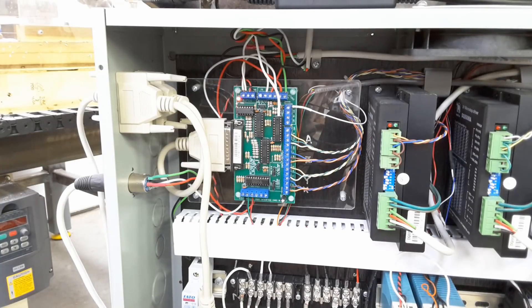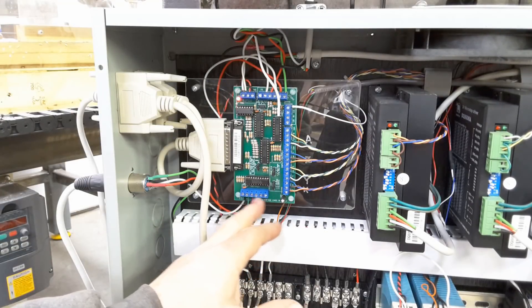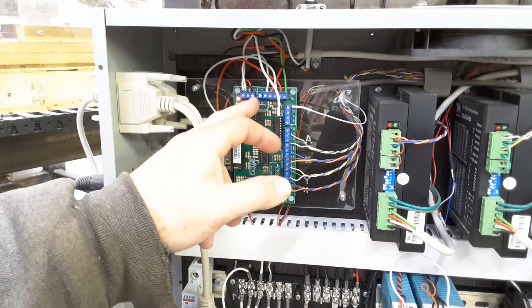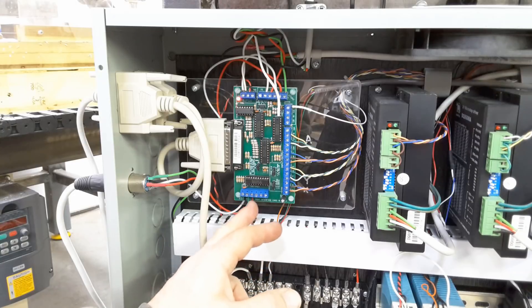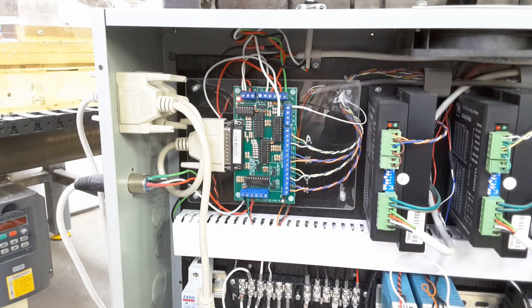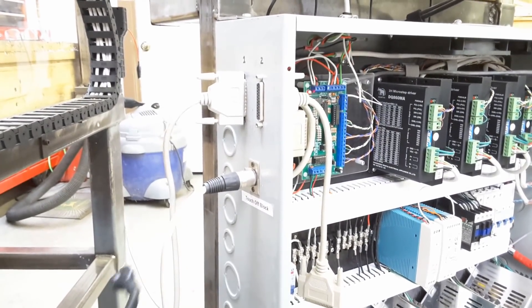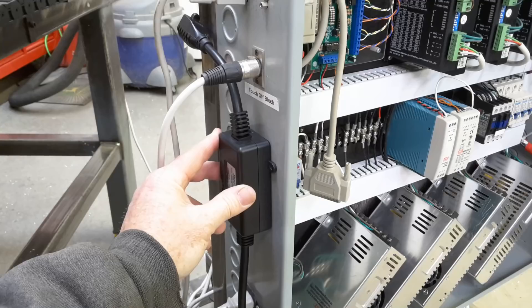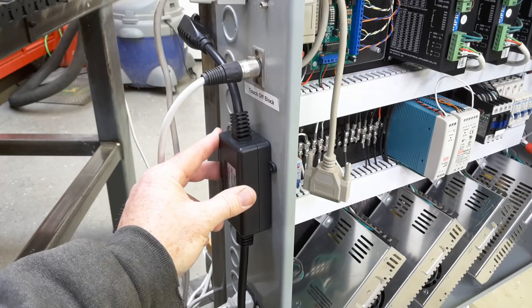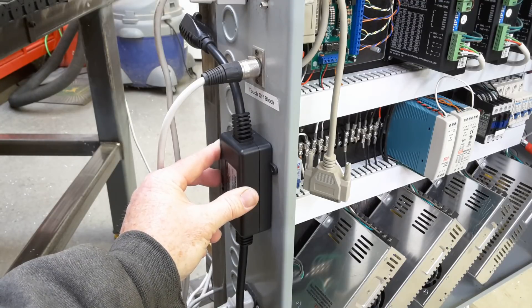Here we are in the business side of my controller box — this is my breakout board. The place where I'm going to hook up this Power Tail is down here; these are the output signals on this board. Everything up here is inputs, and the motors are over here. Right now my outputs are only one, and that's for my touch-off block — that leaves two more. There are three screws, one of which is a ground. I'm going to mount the Power Tail right here on the side. I was going to mount it on the machine itself, but I'd just like to keep it here. I'll put a couple of zip screws in, run some short wires, and we'll see if it goes.